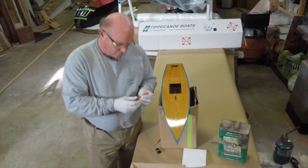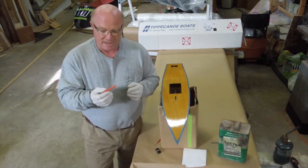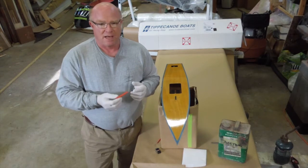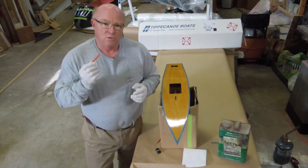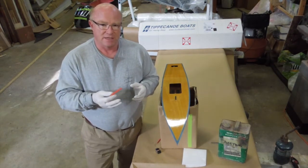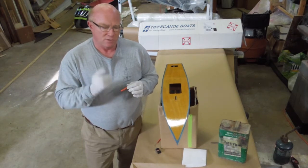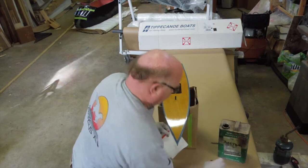Now, bonding the thermoplastics is often a challenge. You can't just take a soda straw or any polyethylene or polypropylene or any of the other thermoplastics, slap a little epoxy on it and stick it. It tends to release. So we need to go through a specific sequence to get it to bond. Now, this is not just for this. If you're trying to bond something else, this will work too. But as with all structural bonds, we want to start with a clean surface.